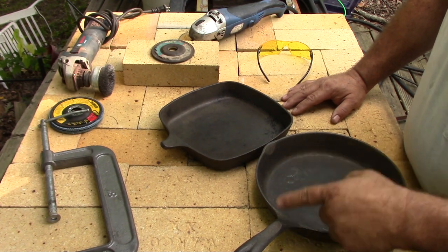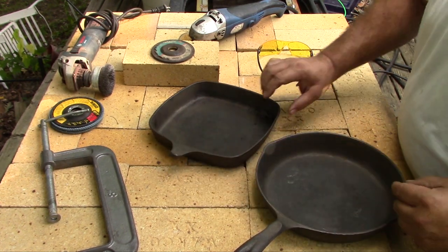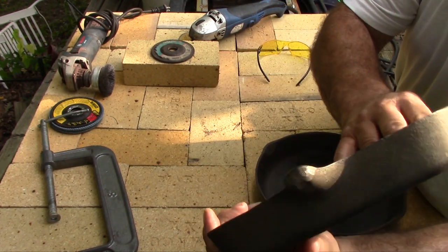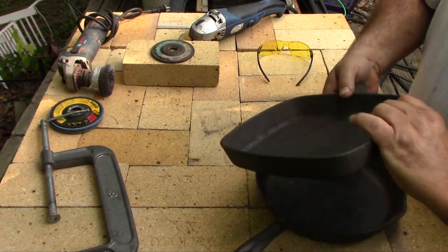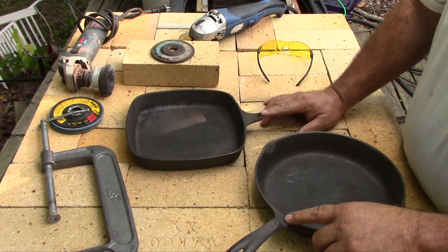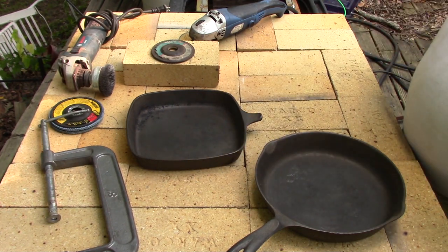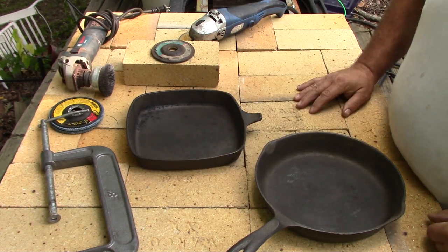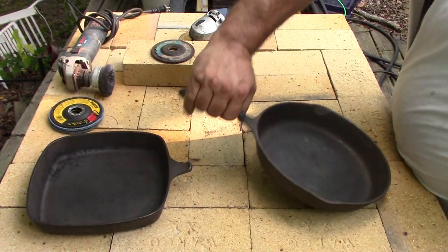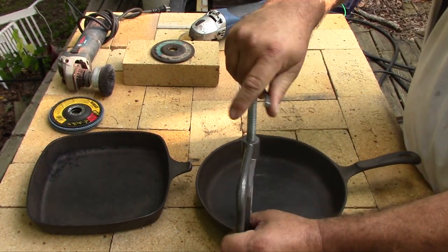What I'm going to do is cut this handle off with a grinder and a cut-off wheel. I'm going to do a little bit of grinding because somebody rounded the end of that off. I'm going to square this up a little bit, and we'll try and shape and trim these so I get as good a joint as possible before we start welding. I've got safety glasses so I don't get steel in my eyes — steel in your eyes isn't fun, I know this from experience.